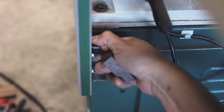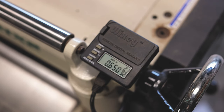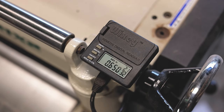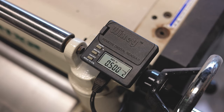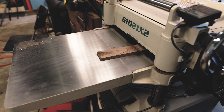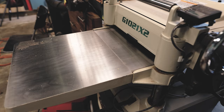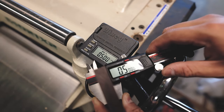I'll use a digital caliper to give me the reading on the thickness of my scrap piece, and then it should show up the same on your readout. Now I'm going to do a test pass just to see how accurate this thing is — I'm going to run the same board through the planer down to half of an inch, and once I take a reading, you'll see that it is half of an inch.